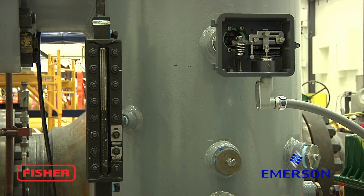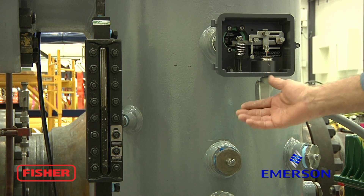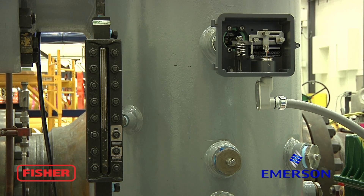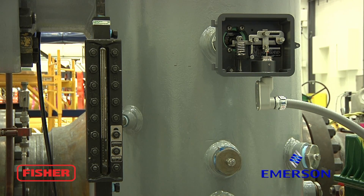So now we're at minimum span and we want to try to use our zero knob to adjust our span in the center of our displacer — it's a little high. We'll bring it down a little bit, rotating the knob to the left. We're a little low, so bring the knob back over to the right somewhat. We've got about a two inch span at the minimum setting, around five and three inches, so that's acceptable.